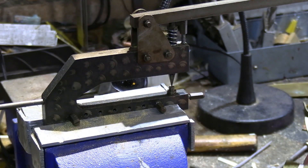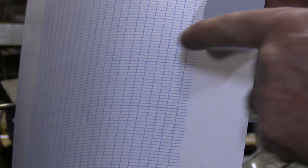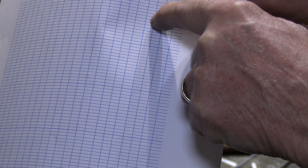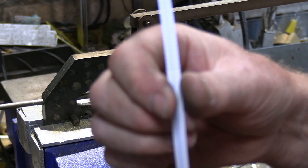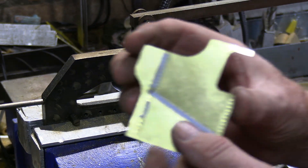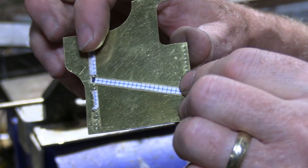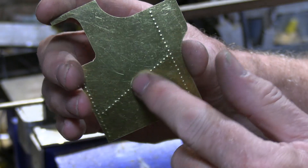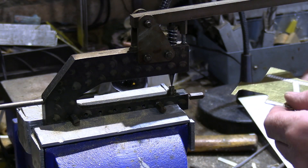These rivets are close together, so what I did was draw a matrix — I'm not sure the camera can pick that up, but there it is — a matrix to represent the spacing of where all these rivet holes are going to be. You cut a strip of this material off, you've got the little marks there, and using double-sided tape you stick these onto the inside of where you want the embossing to start. These are a target for where the embossing tool has to fit, and if you turn it round, that's the result — the embossing gives this rivet effect.